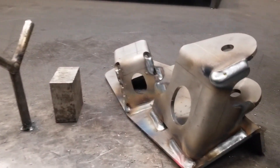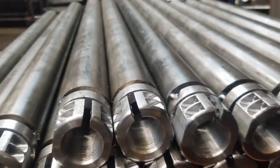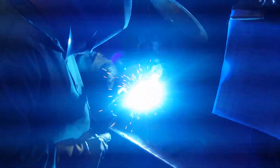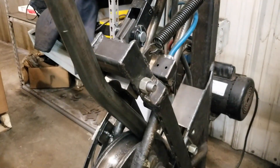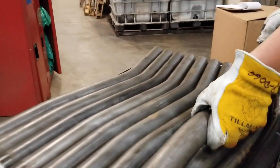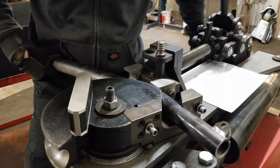The brackets are now ready for clean up and powder coating. The lower arms typically have the clamping end welded on before bending, while the bushing tube is welded after final bending. The bender is set up for the material and a bend degree is preset. The fabricator double-checks the rotation of the control arm so that the direction of the bend is perfect, as accurate bends are essential for fitment. Considerations for bend locations include ground clearance, tire clearance, and clearance from other fixed components such as the exhaust or drive shaft.